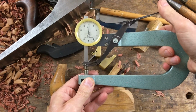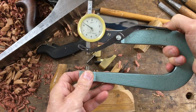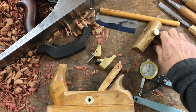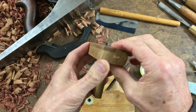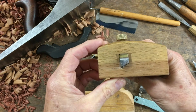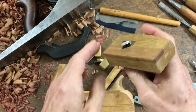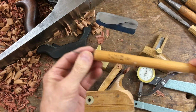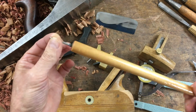Thicknessing caliper mostly gets used in the next stage of making the plates, thinning them out, but I also use it at this stage to measure the height in the middle of the arch. This is a lovely tool from Japan. A Japanese friend bought it for me. He said it came from a third generation family who made nothing but these. It's beautifully made. I use this for marking out the edge of the instrument. Another Japanese tool, a kiri drill, which I'll use for making little locating pins for the plates.